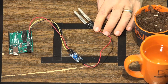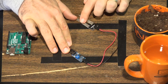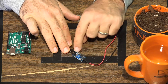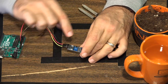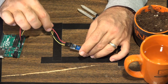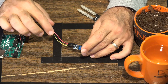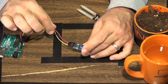Beyond the test materials, this is all that's required for the project — the soil moisture sensor kit. The prongs don't have any processing power; they simply go into the ground with positive and negative wires running to the controller unit, which is the brains of the operation. On the module you have VCC and ground. You can plug VCC into either 5V or 3V — you'll get different readings depending on which you choose, so be consistent. If you set a variable threshold in an IF statement and then change the input voltage, you may run into issues.